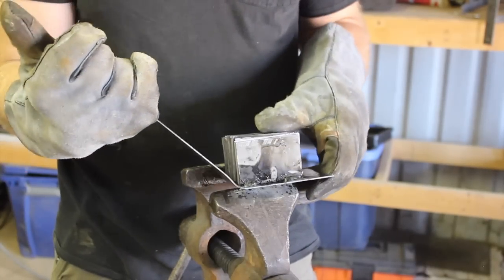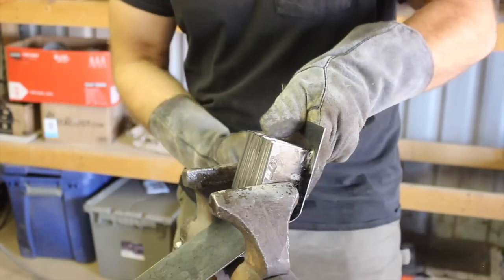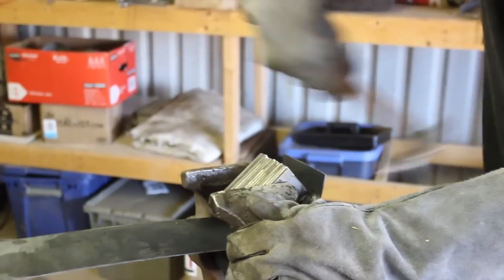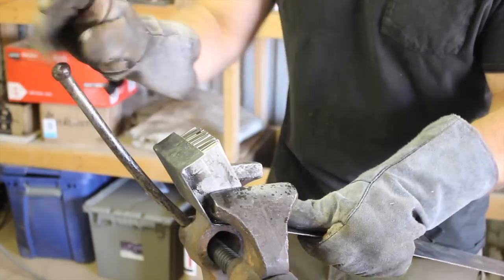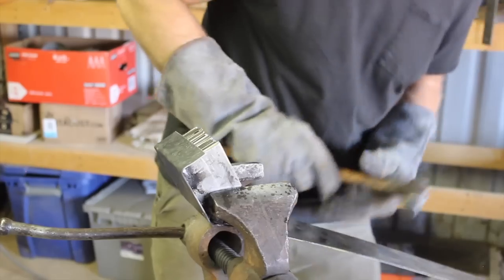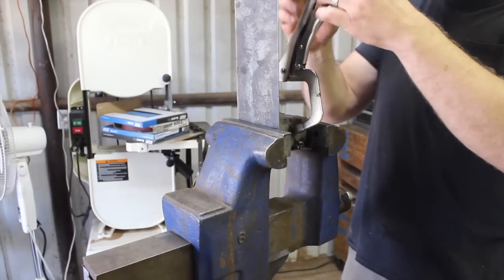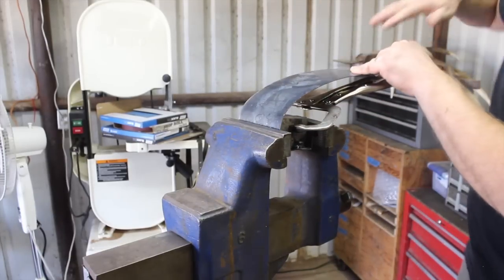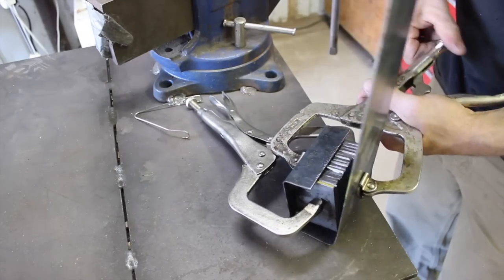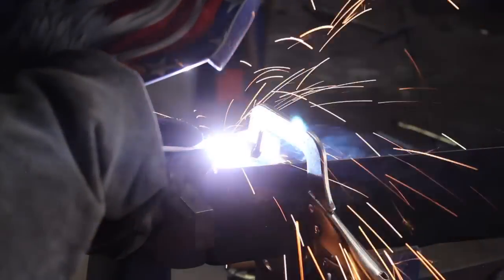That might freak some people out, but it really was not an issue. Any residual WD-40 left between the layers will burn off as the billet heats up. This steel jacket is not airtight — the rod I'm using produces a porous weld, so there are multiple places that are not fully sealed. It's close enough to keep out oxygen, but when doing canister Damascus with powder steel you typically want to drill a tiny hole somewhere to allow for gas expansion when heating. The point is, a little WD-40 burning off is not going to be an issue.